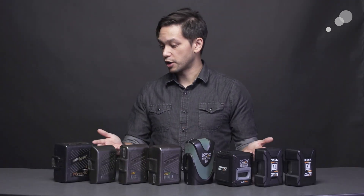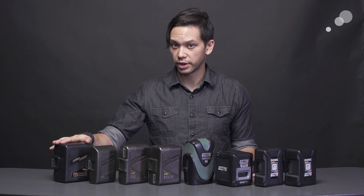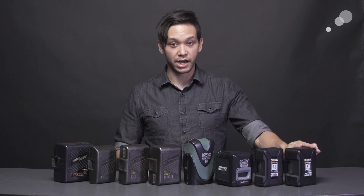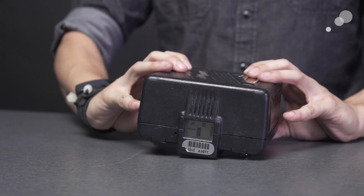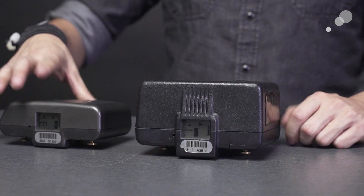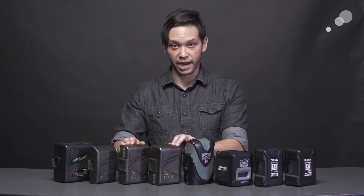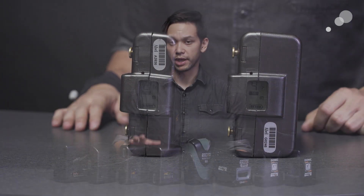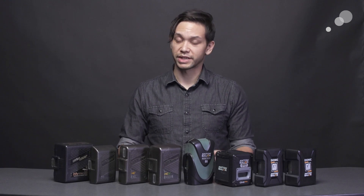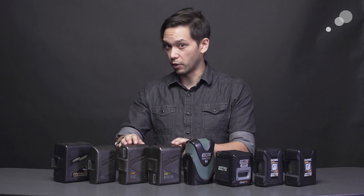We have various examples of their Logic series of batteries here, from the older, heavier Nickel Metal Hydride Chemistry Hytron 140, up to the brand new Svelte and Rugged Dionic XT series. After the hefty Hytron 140, Anton Bauer created the Dionic 90, which is an example of a lithium ion battery in a much more modern chemistry. That was a predecessor to the Dionic HC and HCX that I have here. HC stands for high current, because these batteries can sustain a 10 amp continuous draw without significantly risking the life of their cells. This makes them a much better fit for the increasingly power-hungry nature of digital cinema. Many of you know these batteries very well, as still to this day they are one of the most popular options out there, despite their age.